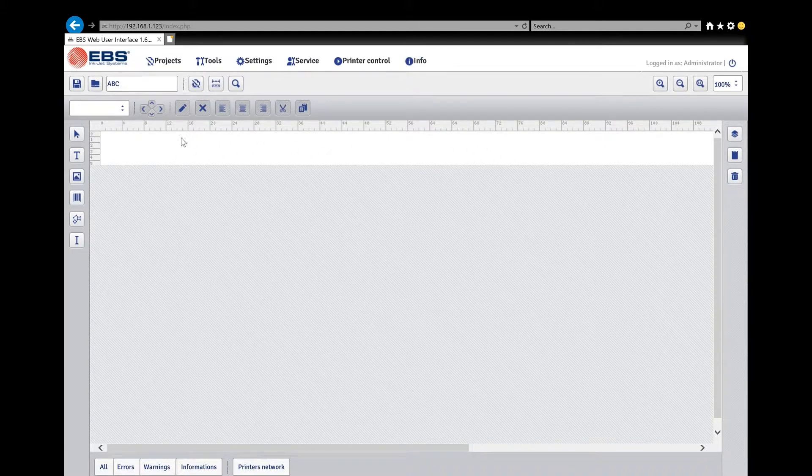This is your editing page — where you make the magic happen. This white box is your field to work within, and it represents your 32 jets. If you're filling it from top to bottom, you're using all 32 jets. Your EBS 260 is a 32-jet printer — if you look at the business end you'll see 32 nozzles. If there's white space between the top or bottom, you're not using all 32. You can also go horizontally as long as you want — if you had a pole 26 feet long and wanted to mark all the way across, you could.